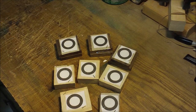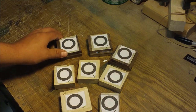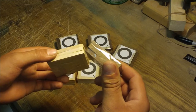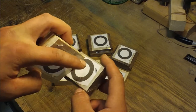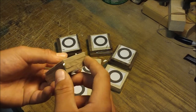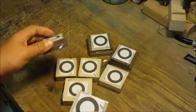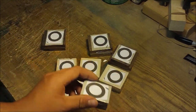Here are the pieces with the patterns on them. What I have is the two maple-walnut ones that have the three pieces of quarter inch on them. Just like all the others, I use the pattern with masking tape and then clear box tape all around it. Since I'm stack cutting all these, I use a three-quarter inch pin nail — and all these combined are three-quarter inch thick so it doesn't go all the way through. I just pound it in and bend it over to hold it a little bit extra.